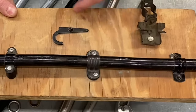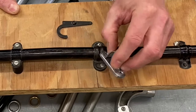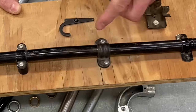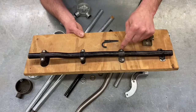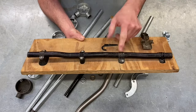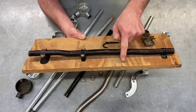Moving along to this one here - this is a spacer bar saddle. Here's a galvanized version of it, this one being black enamel. You undo the two little screws on the front, the saddle front comes off, you secure the back plate onto the actual surface, and then tighten the two screws up. So what's the reason behind using a spacer bar saddle? It raises it slightly further off the surface. According to the old exam question, it would be used where you had irregular brickwork, since a brick wall will never be perfectly smooth.